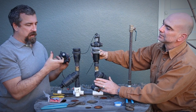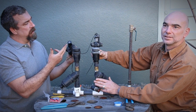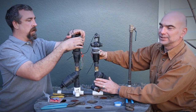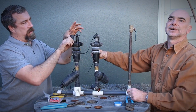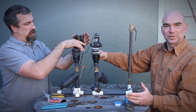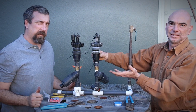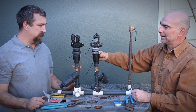Sometimes even replace it. You can see this one is a little black now that there's chloramine. These are just starting to get shot out. I've had to replace a ton of them. Usually after about 10 years, those seat gaskets will start getting really worn and brittle. You can usually find replacements pretty easily. You could also try unscrewing and flipping it and using the opposite side if you are in a pinch, and they work well after that.